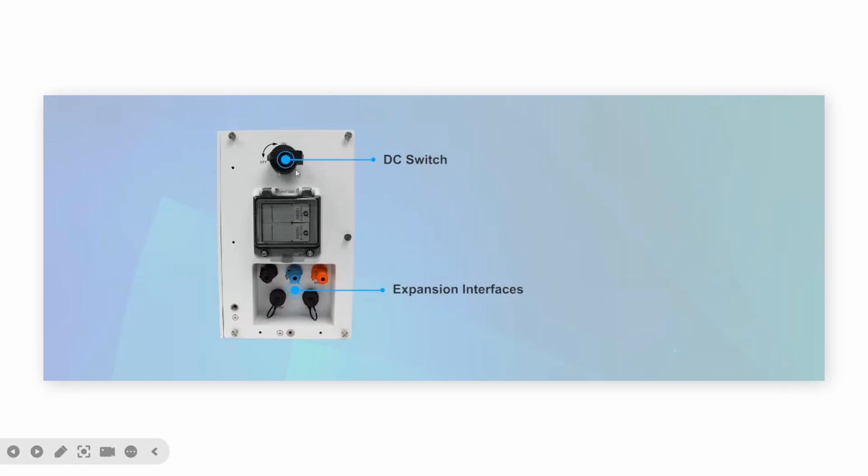On the left side there is a DC switch and an expansion interface. For our three-phase MID device, the inverter can connect to a maximum of two stacks of batteries, which is a maximum of 60kWh. The expansion interface is used when customers have five or six batteries and want to stack them as two stacks. There are also two fuses — if something goes wrong, you can just replace the fuse to solve the issue.